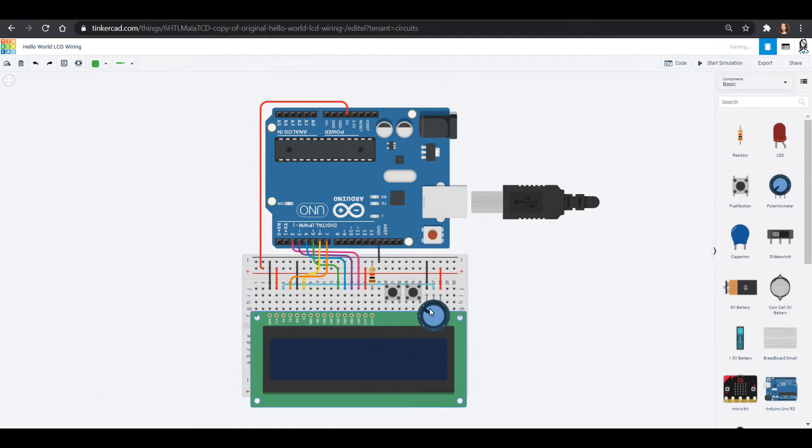I'm just going to move this stuff down a little bit so we have more space for our wiring and to wire up our buttons. I want two little push buttons — if I push this button we'll add one to the team one score, and if I push this one we'll add one to the team two score. The buttons need to go to ground through a resistor on one side, so you can wire both of them up to ground through a resistor, and then we change our wire color to red because the other side of the button is going to go into our five volts.